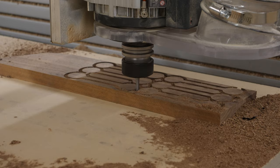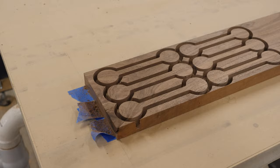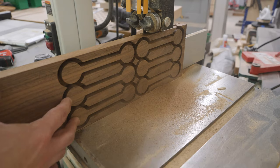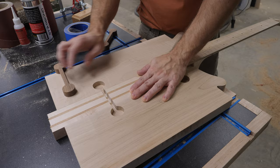As you probably noticed, the CNC didn't cut all the way through these pieces. The main reason is because it would be kind of difficult to hold them all in place, and it's really easy to just cut them loose on the bandsaw. With the dog bones cut free, I'm now ready to do a test fit between the neck, which I made in the previous video, and the two wings that are more or less fresh off the CNC.